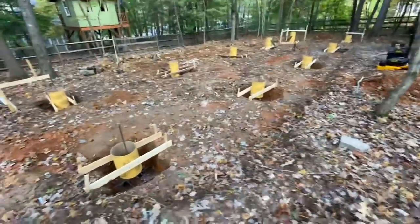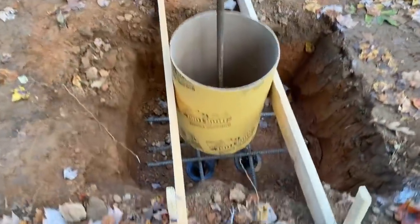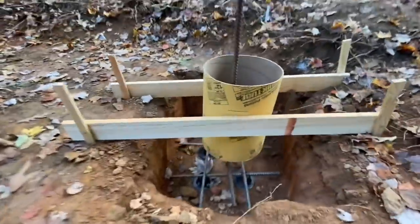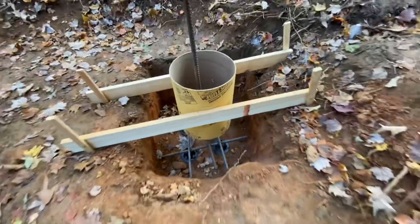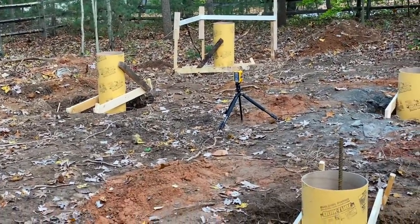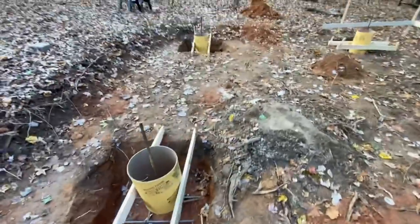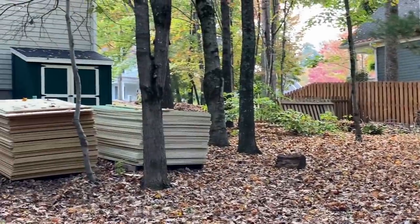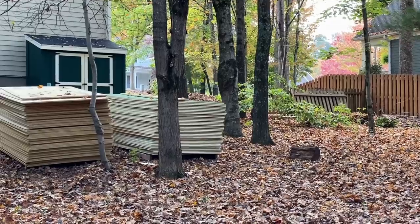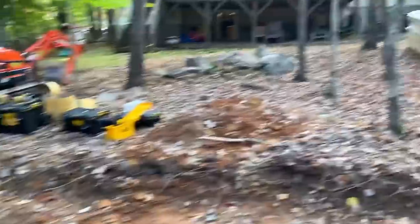Foundation's ready for concrete, and this is after about two days of work. Got it all squared up and dug out — we've got the footings dug with steel down in there, and we've got these sonotubes placed, hanging, and braced using a little bridge system, which is something we've never really done before. The tallest one is about three feet out of the ground, so we put a little diagonal brace on the tall ones. That's a number six J-bar coming out of there — that's like three-quarter steel, big boy. In just a little bit, Johnny's gonna get a taste of pouring concrete for the first time. It's gonna get pumped from way out there at the road, so hopefully they bring enough lines, and hopefully this passes inspection in the next hour before the concrete shows up.